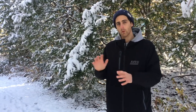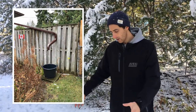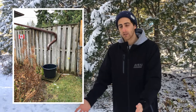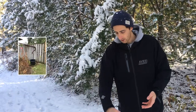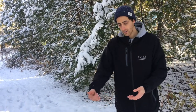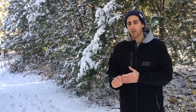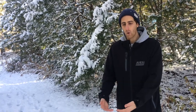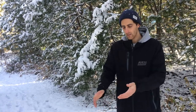That gives you a little bit more room to play with because the threat of water damage isn't as relevant there. So what I like to do in that situation is just move the rain barrel and keep all the downspout arrangement exactly the same. The one thing I do add in the winter is a planter bucket or some sort of large catch basin with holes in the bottom, so that as any water comes through the downspout, it falls into this temporary catch reservoir. The holes let the water slowly leak out, which prevents erosion and gives the water a place to gather before it's let out.